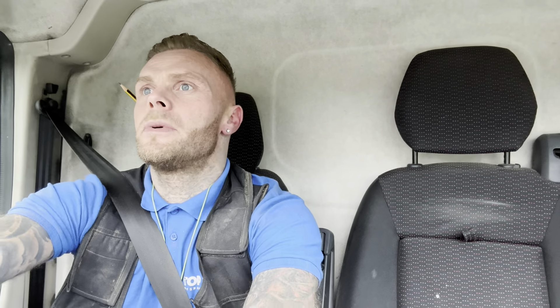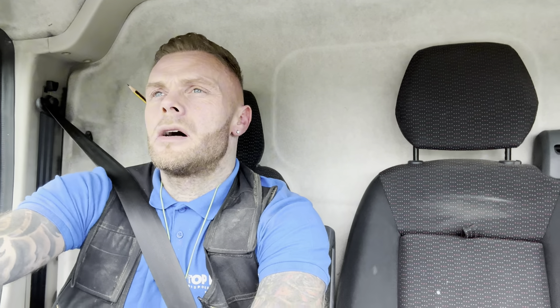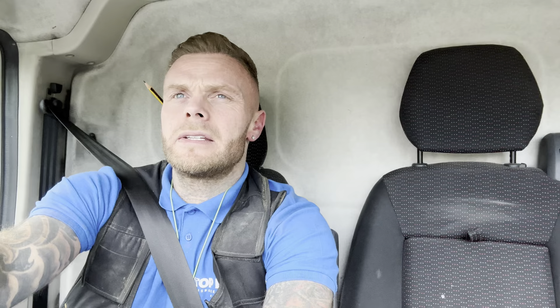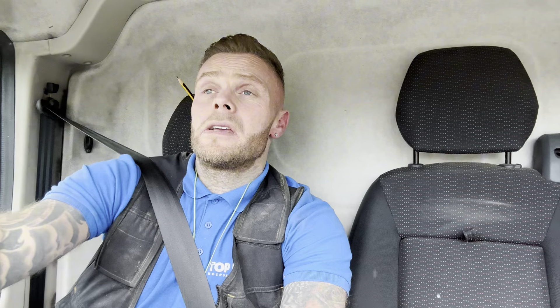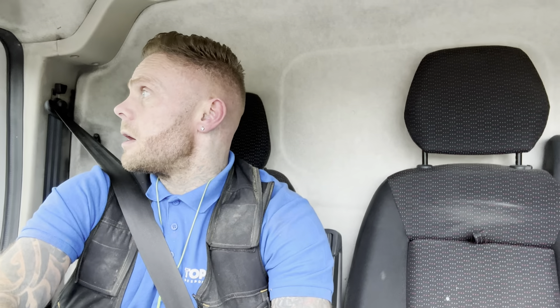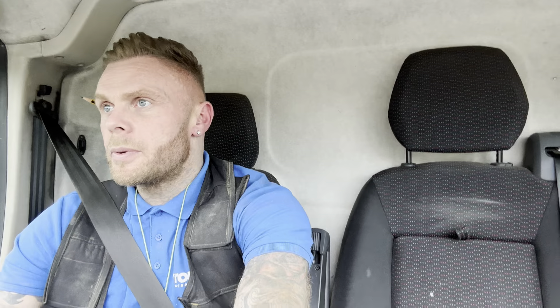When we go to our fix we do spray everything prior - our carcasses, plinths, fillers, the whole lot. Some people leave certain parts off till they get to the fit, but we spray it all. Then for touch-ups on site, I invest in foam - a one-and-a-half fill foam - that we transport everything in, so we do wrap things well to avoid damages. When we get to the fix, if there are little minor things to touch up, say if you scribe something in, nine times out of ten we carry artist brushes and can touch it up. We also have the Graco Quick Shot, which runs off a DeWalt battery - that is brilliant if you have something on a door that needs sorting out.